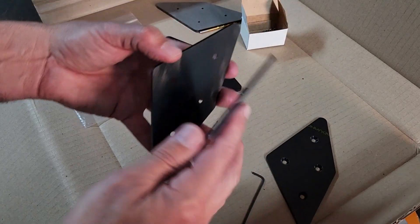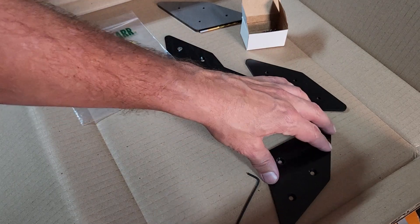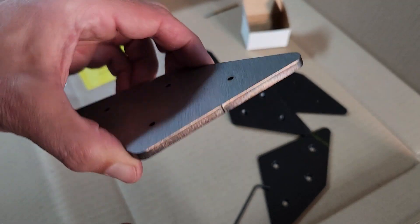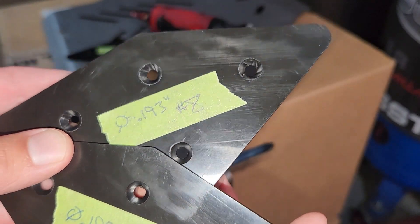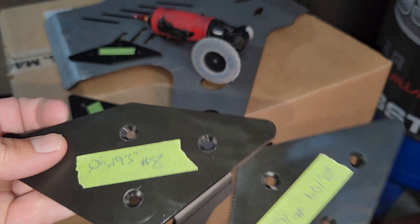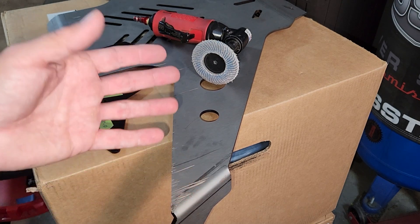I can't tell the difference between the two plates I ordered, so I'm going to double-check my order. I thought I ordered a size eight and a size ten countersink — but that's not going to deter me. The next step is tapping holes. By the way, this is 3/16-inch thick — that's too thick, I didn't have to go that thick. Crisis averted — I looked it up: the ID for a number eight is 193 thousandths, and the other set are closer to 199, so those are number tens. Hard to tell a six-thou difference visually. I'm going to get my flap disc grinder, clean this up a little, probably hit it with a Scotch-Brite pad too, and let's get to drilling and tapping.